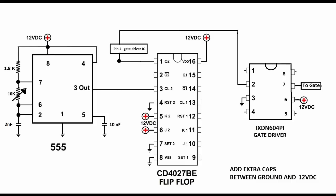This method for me is the easiest. You could build one yourself — it's not that hard if you're into electronics. It's simply a 555 timer chip. And because those are very hard to get at exactly 50% duty cycle, you use a flip-flop. A flip-flop gets the signal from the 555, and the output of the flip-flop is half the frequency of the 555, but exactly 50% duty ratio — and that's what I always want. This signal from the flip-flop doesn't have enough power to drive a gate, so I connect the flip-flop output to a gate drive IC.